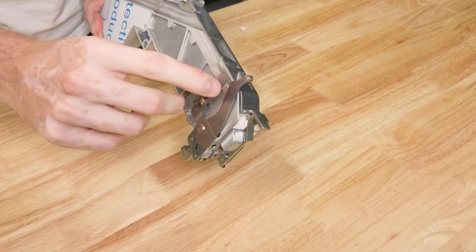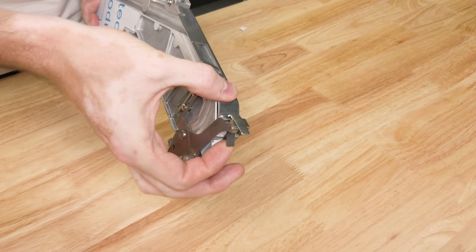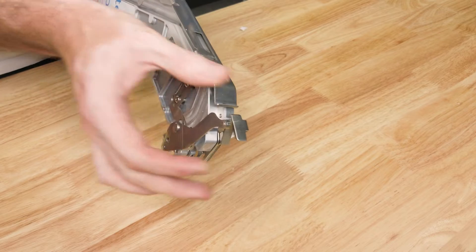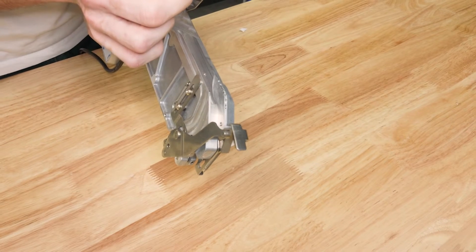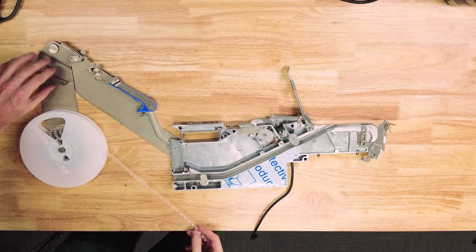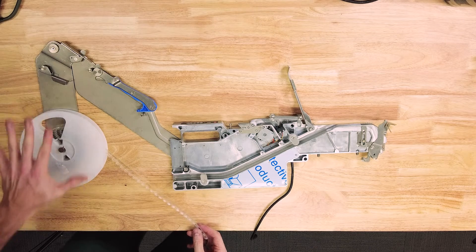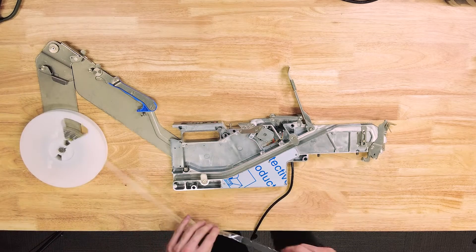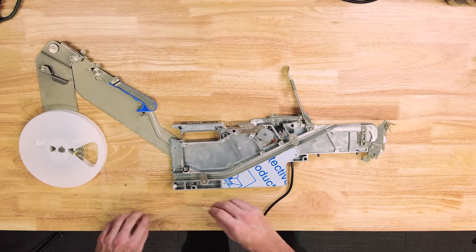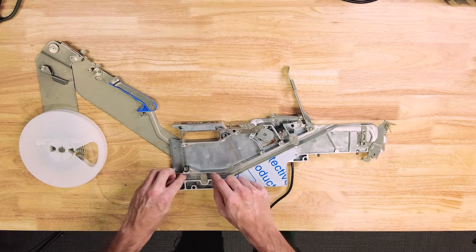These feeders unlock a little bit differently. Make sure the locking arm is forward on this one, and then pull this latch up and forward. Sit your reel in the holder. For larger reels, there's a retaining tab here — a little sprung tab — just to make sure it doesn't bounce off. Then feed the tape and film through the channel.